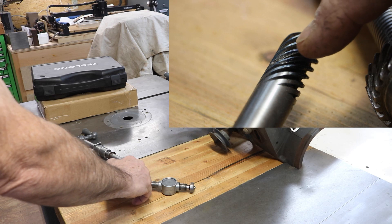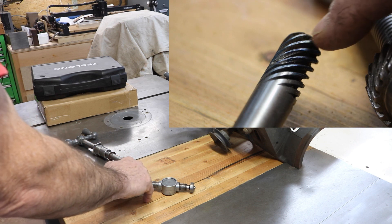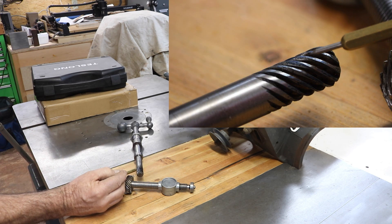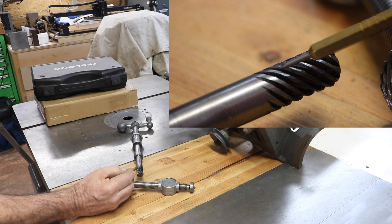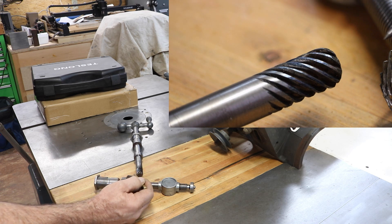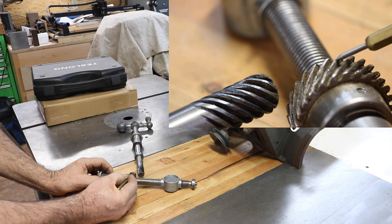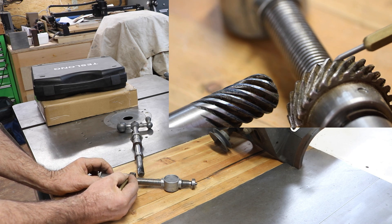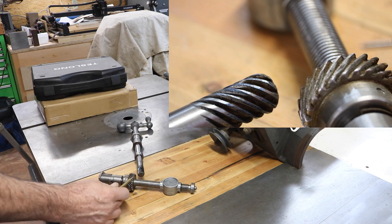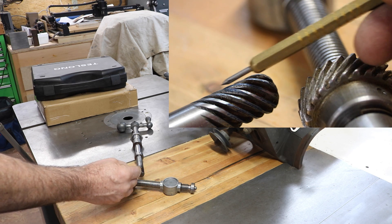So we're going to go into this and take a look with the endoscope and do an inspection. You can see here how these gears are completely worn out — they're very sharp-edged and there should be a nice flat top surface to them, not a razor sharp edge like these ones have. Right in here this has a nice flat top to it, this flute here, and these ones have razor sharp edges worn on them, so they're all worn out. It mates with this gear here — in the video it's very hard to see, but these are very sharp-edged where it should be pretty much flat across the top.